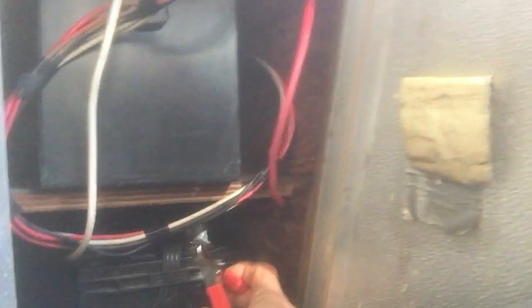As you can see here's the positive cable, and you'll notice out here I've got the positive on the plus — it's red. That reconfirms my suspicion that red was the hot, or the positive. Now we're going to run back in and make sure the charge controller is up and running and registering the electricity stored in those batteries.